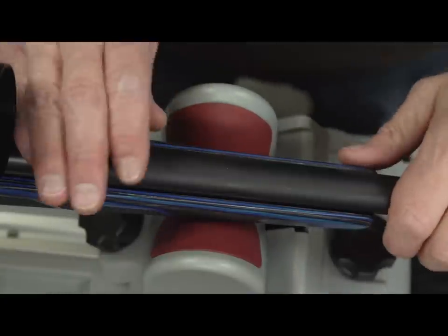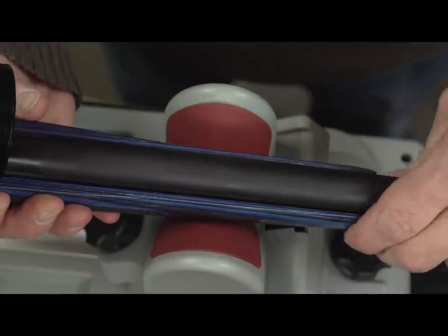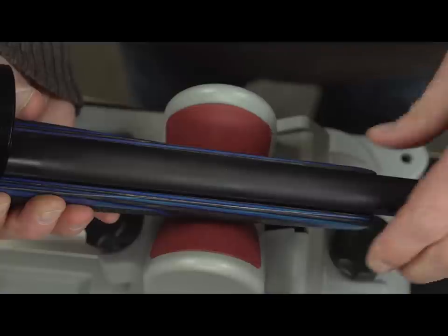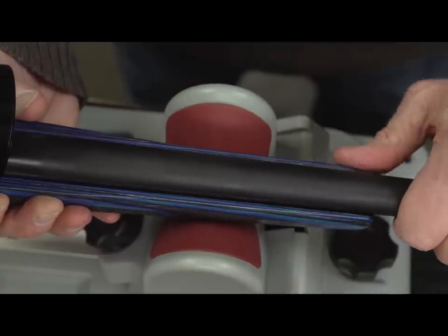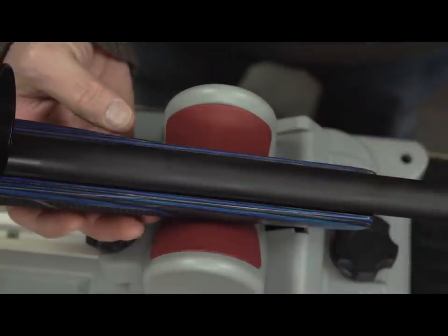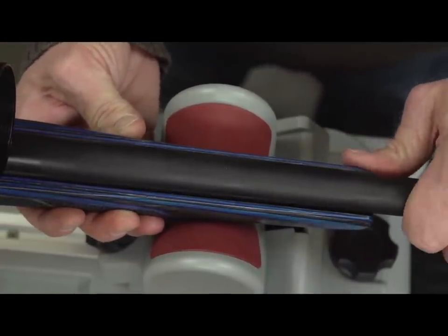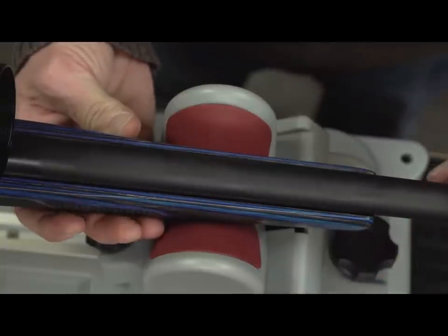One last important note: with most firearms when assembling, it's possible to hold the barrel either right or left when you tighten the action screws. Don't expect it to pull the barrel to the center, because in most cases it will stay where you tighten it. This can cause the barrel to lose its free float. To completely eliminate this, you may want to watch our bedding video.